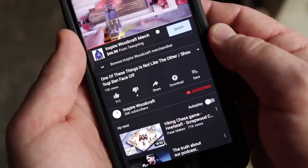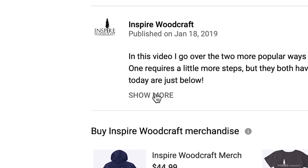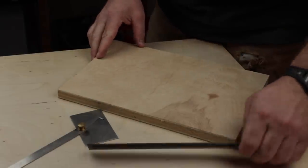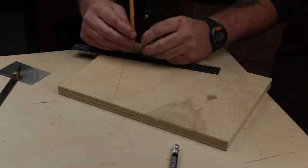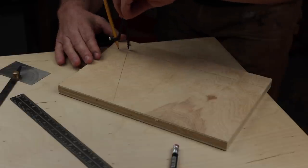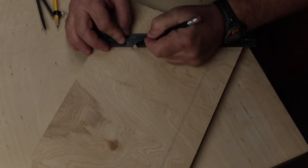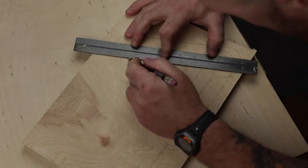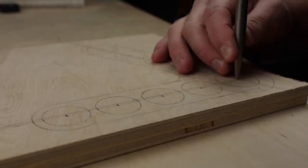Let's jump into the build and see the thought process that went behind making this. Links to some of our other videos and items we used in this video can be found in the description box below. Now, like most of my projects, this all started with a layout. Here I'm using three quarter inch plywood, and I'm drawing everything out by hand. The angle ends up being 65 degrees on the protractor, and then an inch and a half circle is drawn where those two corners meet. After that, I would mark out where I wanted my inch and a quarter circles to be and space them all a quarter inch apart.